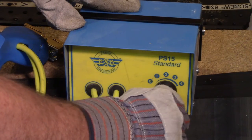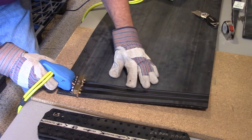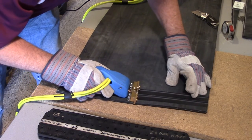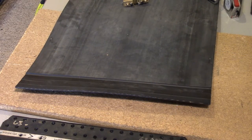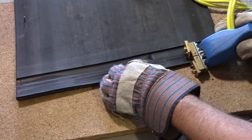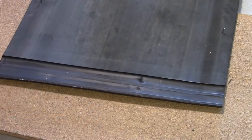I have left 2 areas less than the width of the 7/8 inch blade, so to clean this up I will drop the setting back to level 2. This level allows me to cut the remaining top cover without overheating the blade. Repeat this process on the other end of the belt. This will set the super screw down level with the top cover to minimize the exposure of the splice to the conveyor belt cleaning system, i.e., scrapers or wipers.